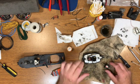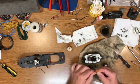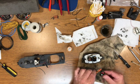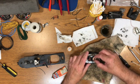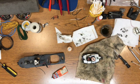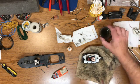But again, I'll reference my book, make sure we have it, because I think that's why we had that extra wire left over that wasn't connected. So I'm going to put the armature in with another dab of grease on the worm gear and make sure it's in place. It's turning the truck, so we'll get ready to get the brush plate now.